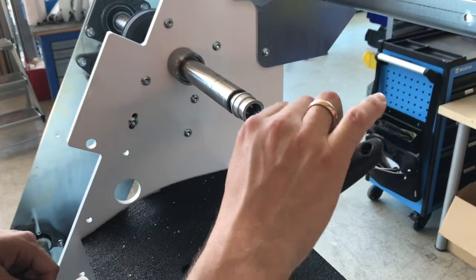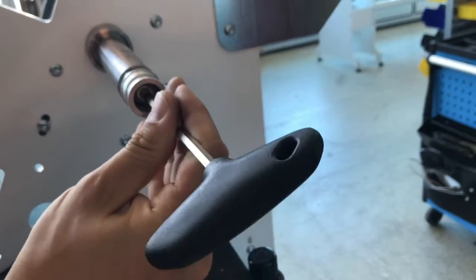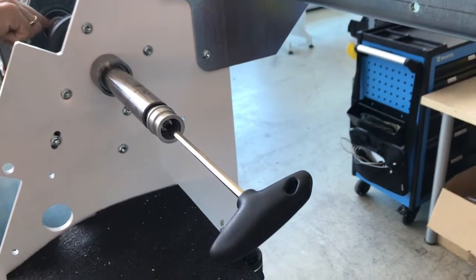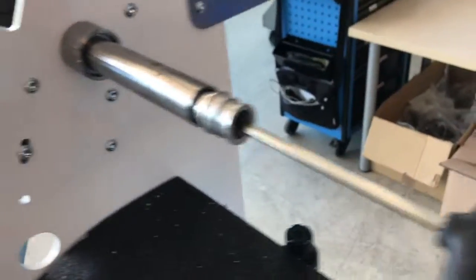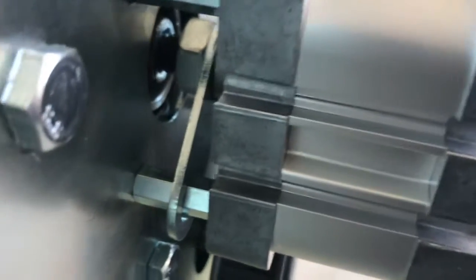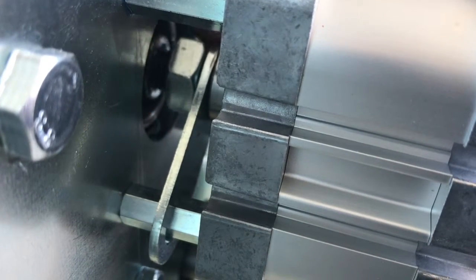In the middle of the turning decoupling you find a screw for an allen key which lets you unscrew the whole unit, including a threaded rod that goes inside into the pneumatic cylinder. But before you can actually unscrew it, you need to open the lock nut.